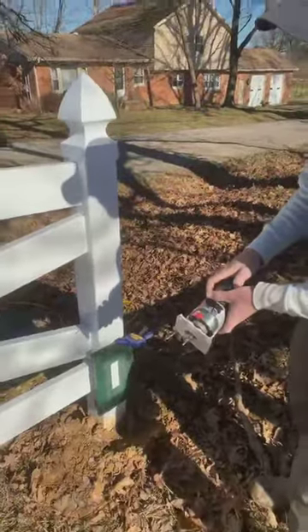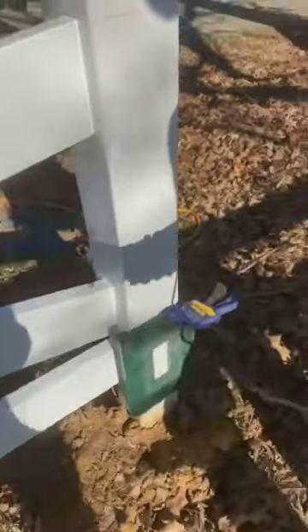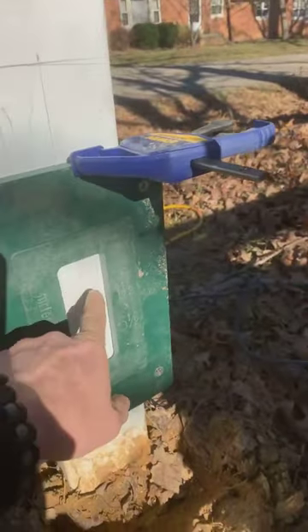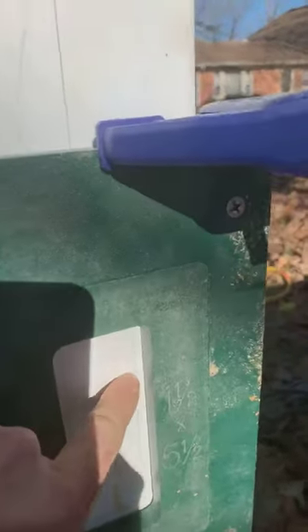Sean here is going to use that, let me videotape and show you how that works. He's got a custom router bit on the bottom of that. It has a collar and offset bearing, and that bearing will follow the inside of this template, but the router bit will be offset by 3/16 of an inch. You see that pencil line right there? That's where the hole will be.